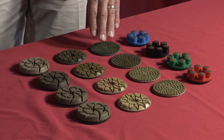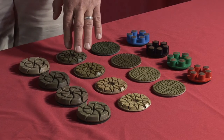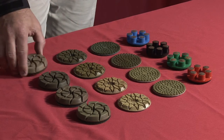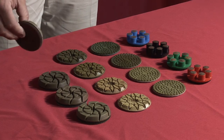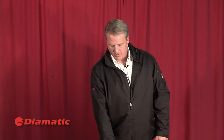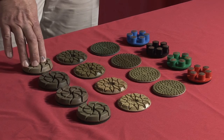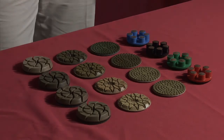Under light machines, we see 3mm diamonds and still some dots. Under heavy machines at a lower price point, a 6mm resin. And now on a 12mm resin, a much higher life point with a rubber back to help with the flex coupler and flex on very uneven floors. These diamonds will typically give you 5,000 square feet, 8,000 square feet, and upwards of 10-12,000 square feet of life.